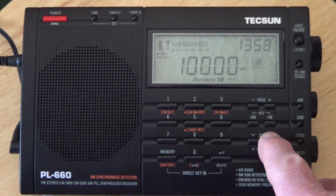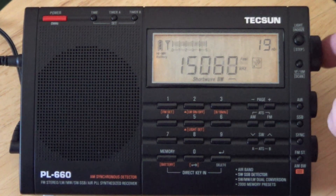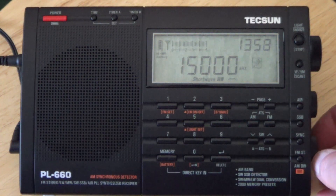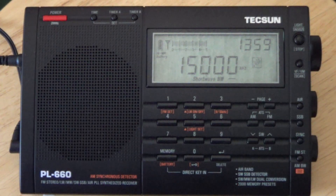I'm starting to get a little nervous — I did hear it before. Looks like 15 MHz is going to be our only real hope. Oh, there it is! I just heard a tone — there's WWV. You can hear the clock ticking. We'll wait and see if we can pick up Kauai as well as Fort Collins. It did pick up really well earlier. I was picking it up on 5 MHz earlier, and now it's all shifted up to 15 MHz. Maybe 20 will come in really well today.